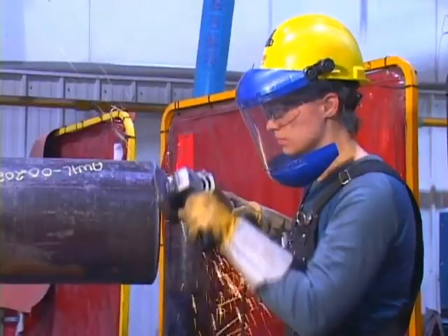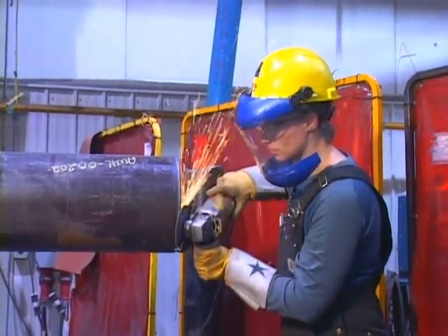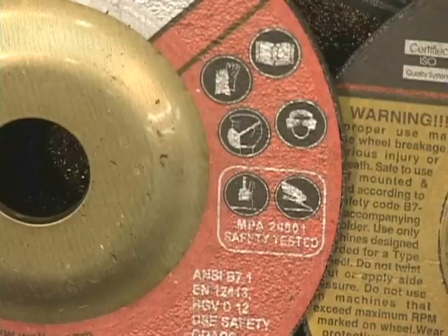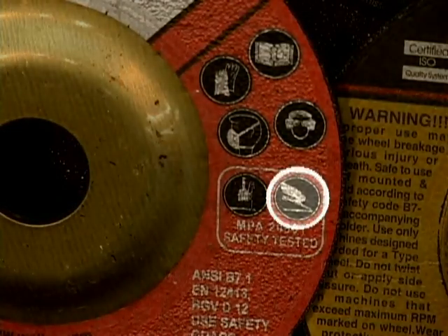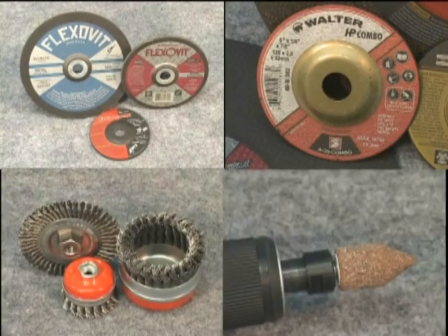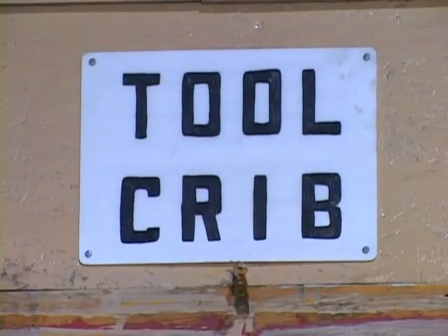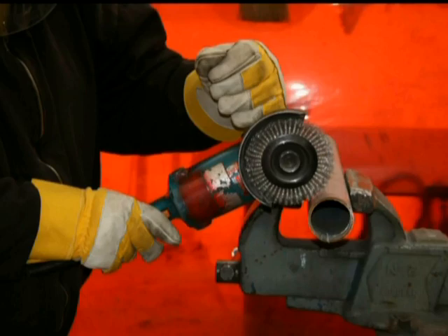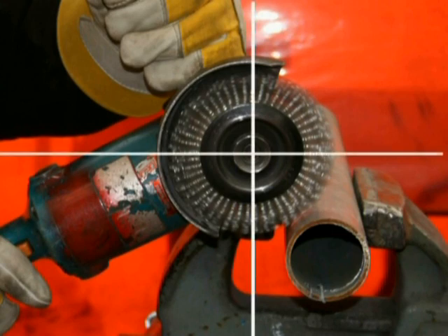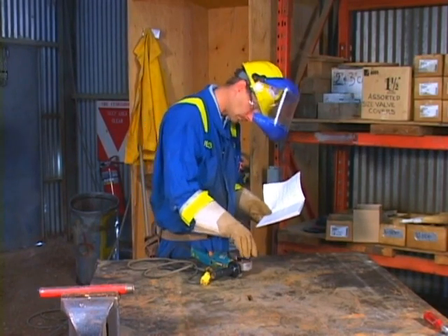Only use the rim edge of the abrasive tool for grinding. The angle at which the abrasive disc contacts the material is extremely important, both for safety and maximum efficiency. Check the disc specifications for the correct angle of use — a common recommended angle of contact is 15 degrees. The first time you use any particular wheel, disc, brush, grinding cone or stone, check the specifications or ask for advice. In general, never allow contact with the material above center — always below. A kickback or jamming effect can result from incorrect placement. 45 degrees below center is the commonly recommended contact point, but check the manufacturer's instructions.